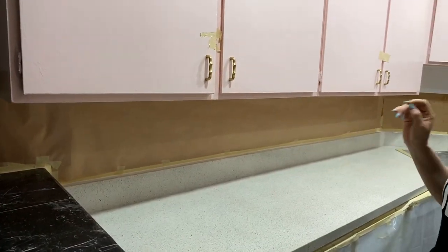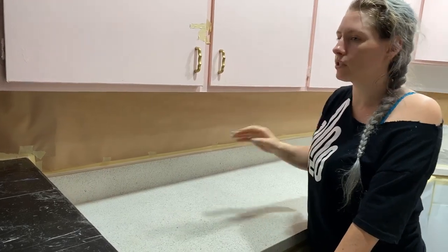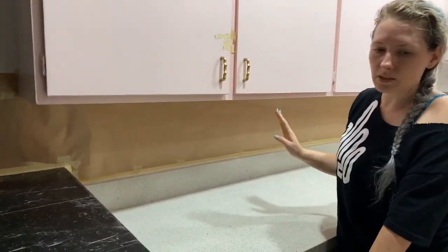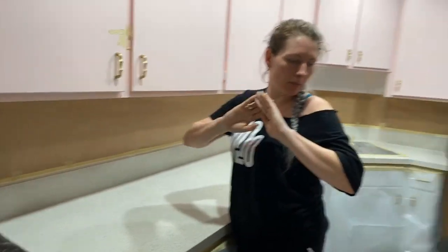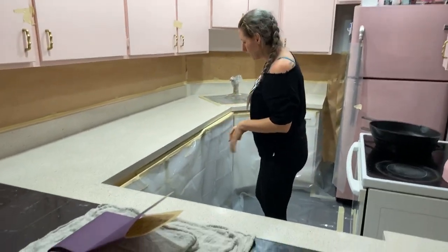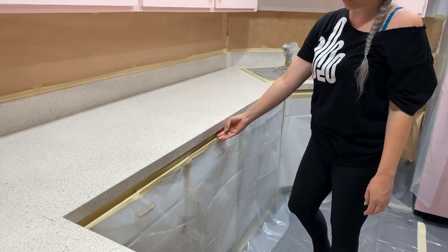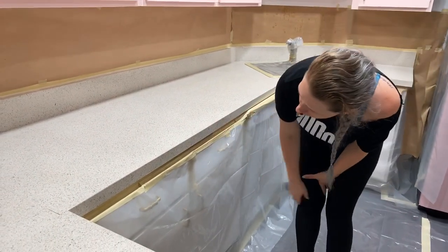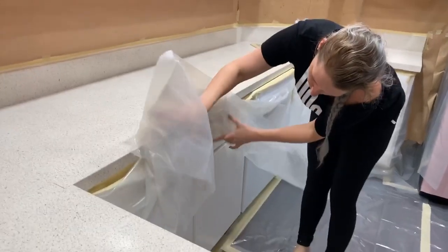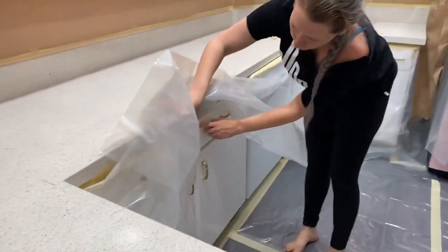It's easy to wipe it off when you notice it, but when you're doing something like a countertop it's very easy to not see where it drips or splashes until it's too late, and I don't have her wall color paint — so better safe than sorry. For appliances and drawers, we taped the top of each drawer and the top of each appliance before taping the tarps to it. We pulled the drawers out slightly, taped the drawers, pushed them back in, then put the tarp over it, with tape added prior to the tarp all around the top of everything.